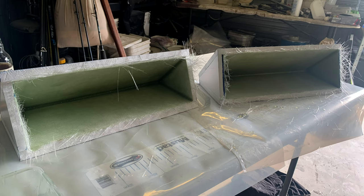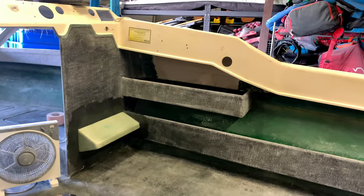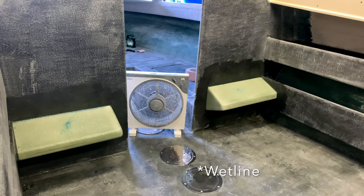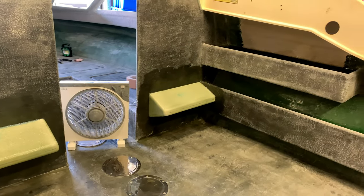I also decided I wanted to have footrests put back into the boat, so I made them up as well. You'll notice they're made out of a white material — that white material is called NEMA board. I think it's got a different name now; if I can remember it, I'll throw it up on the screen. Super easy to work with, not at all itchy. They use them for like the kickboards of kitchens and stuff like that. I got a sheet from a local cabinet maker and just use that for a few little bits and pieces. Glass seems to take to it really well if you key it up well.